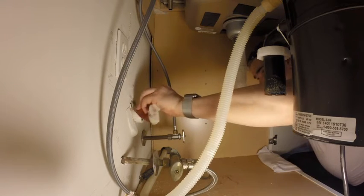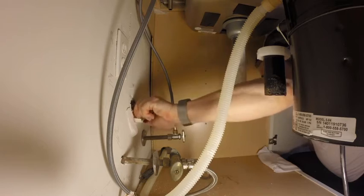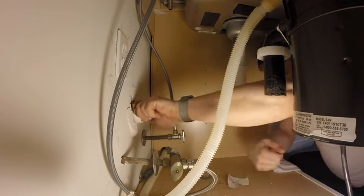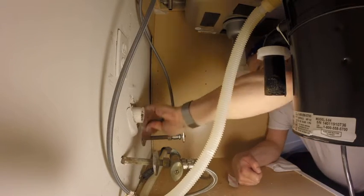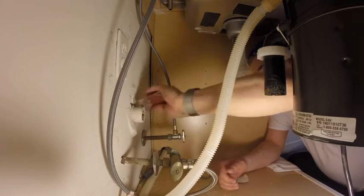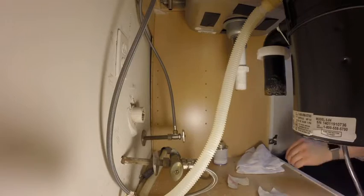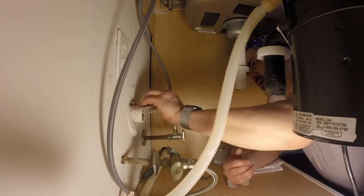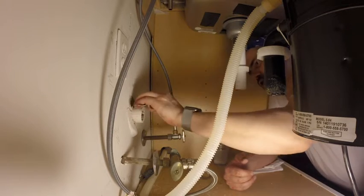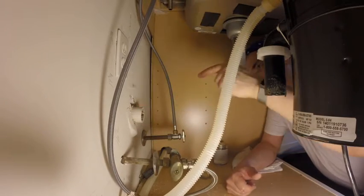And more importantly, you wanna make sure all this surface is somewhat clean. Looks like there might be some paint on here. You see, what will happen is if you don't clean this stuff off, the purple primer will not properly get that plastic PVC Schedule 40 ready, so you can then apply the cement. So you gotta make sure that this is really good. And don't rub this way. You wanna rub in a circular motion, because if you don't, you can put grooves this way that the water could seep through.